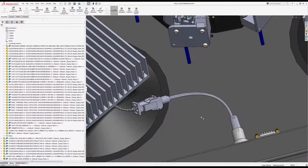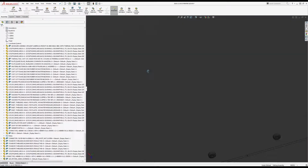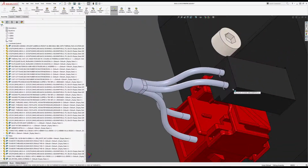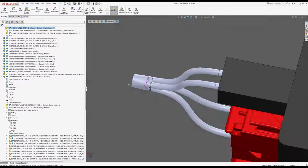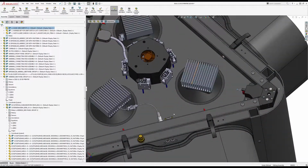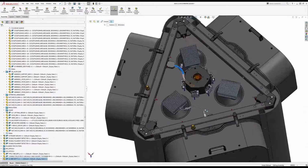All right, so then I'd basically repeat that same process 2 more times for these 2, and I'd also repeat that last process again over here. So I'd have the 3 wires go into here, make those all into a single part. And then, as you can see here, you can do kind of the same thing to combine them. So basically this diameter or this face is the diameter of these 4 wires bundled together and tightly wrapped. That way, by doing that early at the connection, I can run just 1 wire across instead of 2, or when you start having 4 or 5, or like here I've got 24, I'm not going to run 24 individual wires. So at that point you can just start combining them.